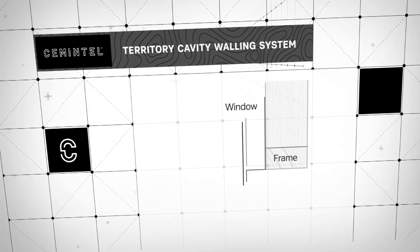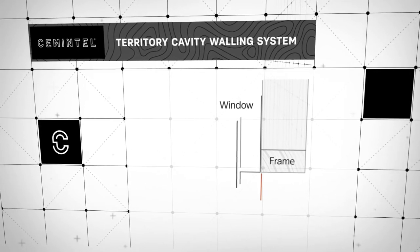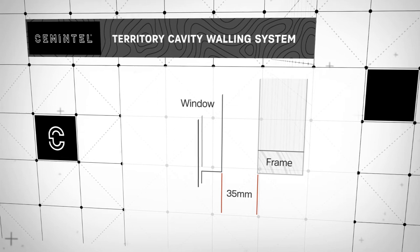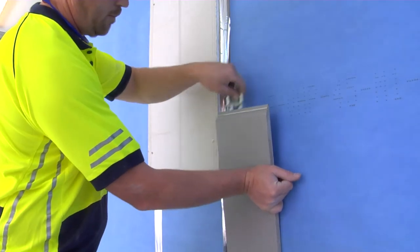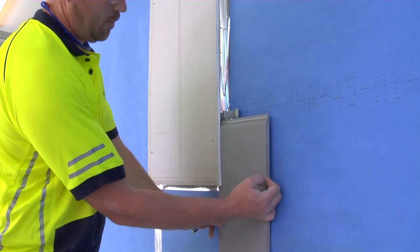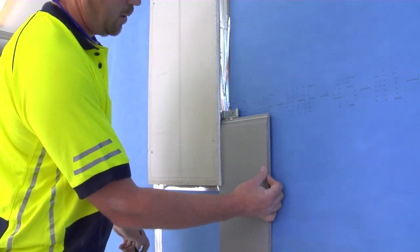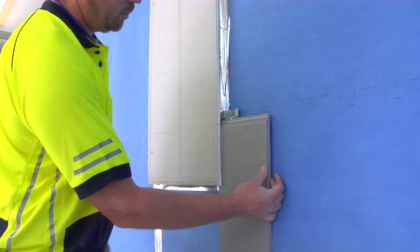The back of the front face of aluminium windows, or any protruding object with a reveal, needs to be set 35mm out from the face of the whole frame. When ordering windows, it is really important to take account of the cavity depth when determining the size of the window so that the back of the face of the window, when installed, sits flush with the panels. This allows the wall panels to slide snugly into this gap, allowing a weather-tight seal.